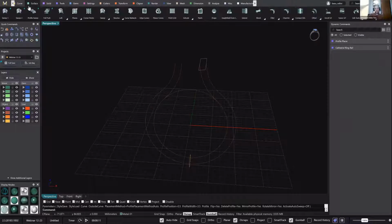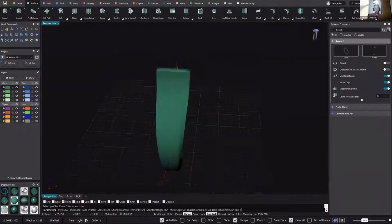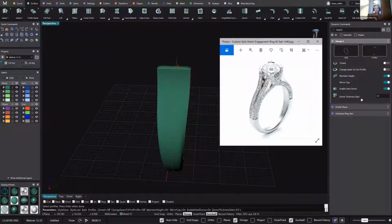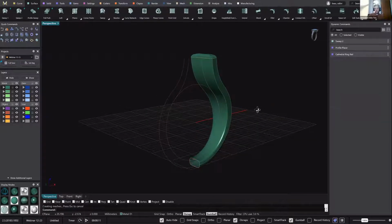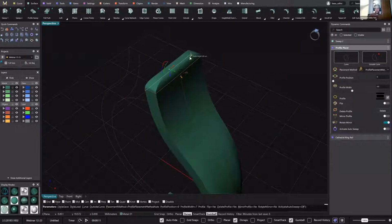So now I can do a 2-rail sweep, inside, outside, top to bottom, right click. So you can see it gives me pretty much a mirror image of what this would look like, maybe a little bit wider up here, if it didn't have that cut, right? And I can adjust this. Let's turn mirrors and turn the bottom off. Okay, so I can right click, and then I can always come back, select this profile. If it's too wide, let's go to 6.5 and right click.